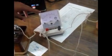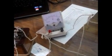Now we introduce the parallel connection of the small resistance into the circuit and draw out the resistance that gives half the deflection of the original reading. Fifty ohms gives a reading of four units, which is approximately half of the original value. We now have R equal to ten thousand ohms and S equal to fifty ohms. Using the formula — resistance of the galvanometer equals R times S divided by R minus S — we calculate the resistance of the galvanometer.